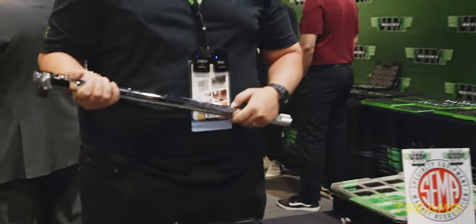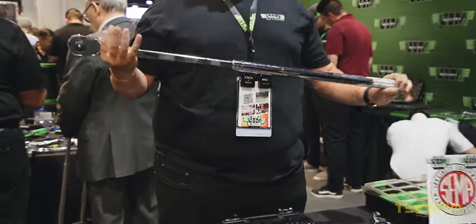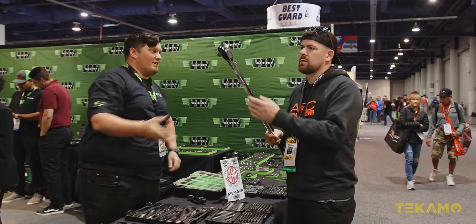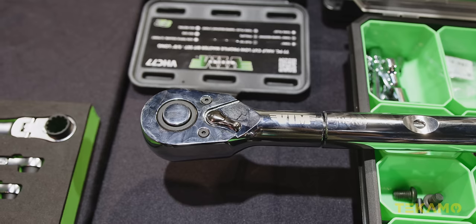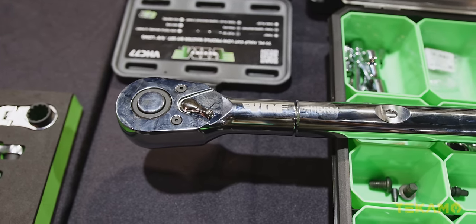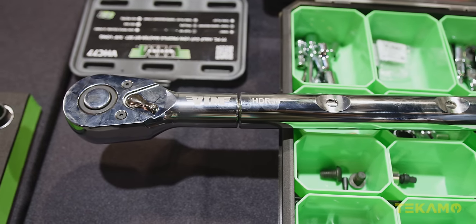So it's extendable — a three-quarter ratchet, up to 48 inches overall length. Normally you have a three-quarter ratchet and what's out there now is 24 teeth. Our head consists of 48 teeth. Technically you have half the degree of sweep — not that you're in a tight spot, but there's not so much space between clicks. Holds up, no problem.